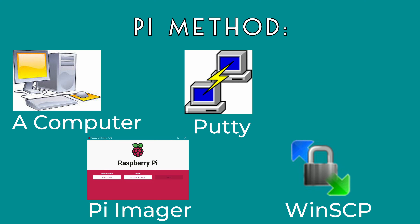Once you do have this set up, you'll want to go into the advanced settings — that's where they hide all the good stuff. You're going to want to do a PID tuning on both the hot end and the bed. You only have to do a PID tuning after you change something, like putting a new heater on your printer or a new bed with a vastly different type of material. Luckily it's really easy, automated, and you don't need to do it that often.